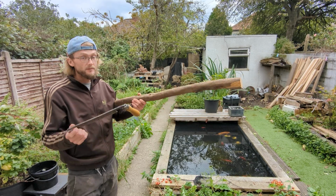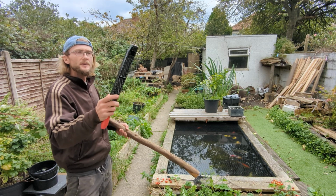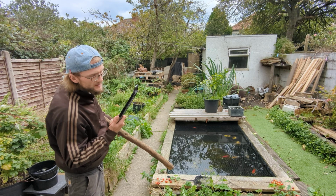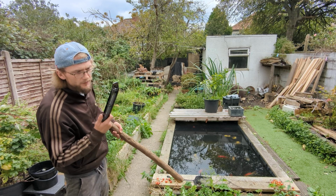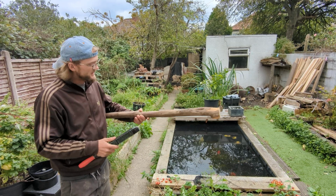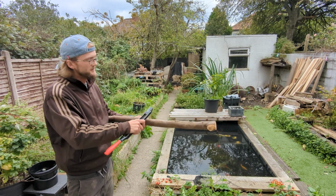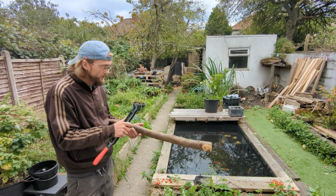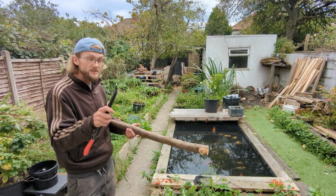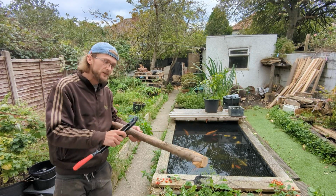So yeah, good time to mention the next tool. I just went and picked up a replacement blade for my, what does that say? It's a Stanley Surform rasp, Ferrier's rasp, I believe that is. This guy is what you take to your knots, because that's going to shred through your knots rather than trying to cut through them. If you've got a nice sharp blade and you're nice and gentle, you can do it. But the rasp as a tool I just wouldn't be without, considering how many problems it solved for me. Rip something up and you don't want it to dive, you're right.